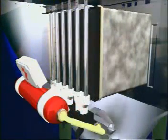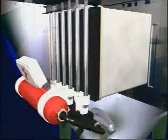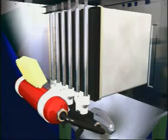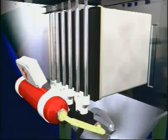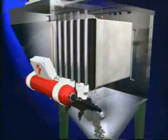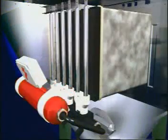To keep the media clean, groups of filter pockets are cleaned alternately by compressed airjets shot inside the pockets. An electronic panel controls both the sequence and the length of the intervals at which the solenoid valves fitted to the air distributors release air from the externally mounted pressure tank.